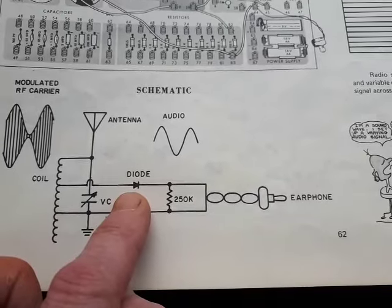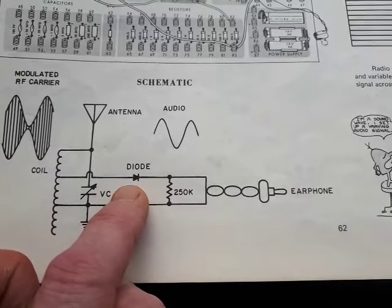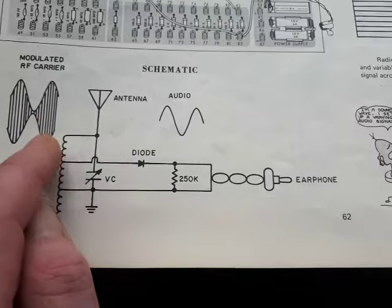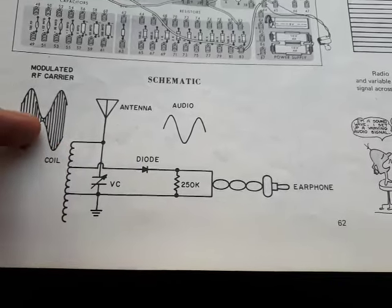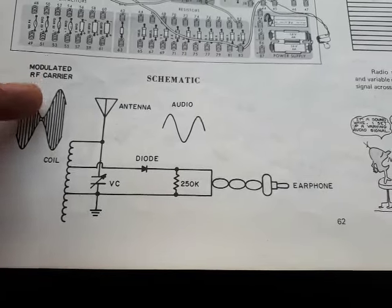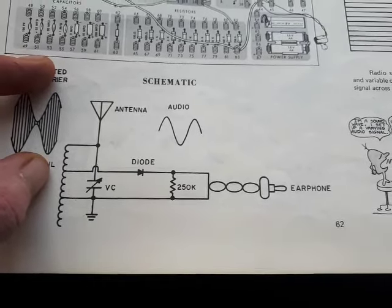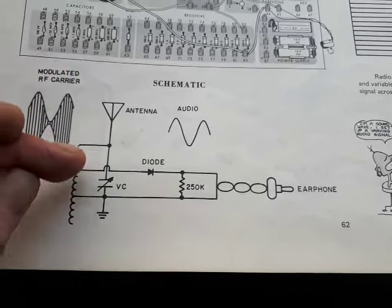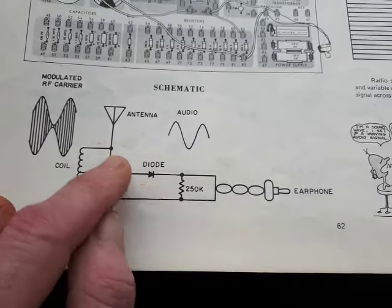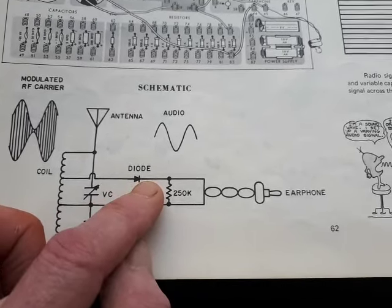The difference between a germanium diode and a silicon one is the germanium diode switches on at lower voltages, ideal for the weak radio signals that are coming in. Because this might only be half a volt from the zero to the peaks in both directions, positive and negative. So it could be just 1 volt difference across there. It's tiny, and only a small amount of current. So these are ideal for these applications. These handle small currents and small voltages to switch it on.